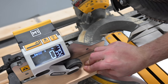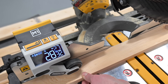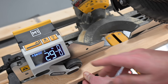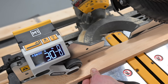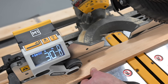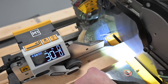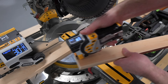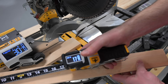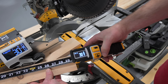Let's make a cut for 30 inches. Slide the material — no speed limit, just nice, steady, smooth motion pushed up against the back of the fence. Once we're at 30 inches, make the cut and turn on the vacuum. X marks the spot — 30 inches. Let's check the measurement. Boom, 30 inches on the dot.